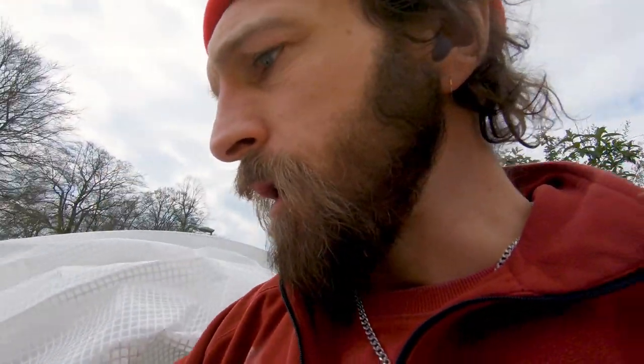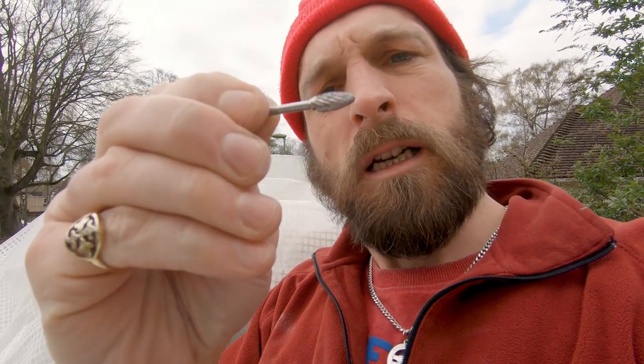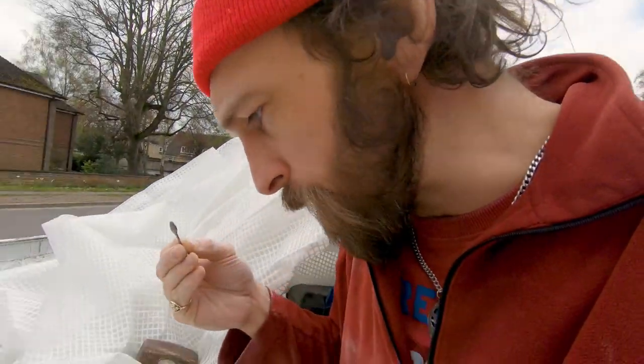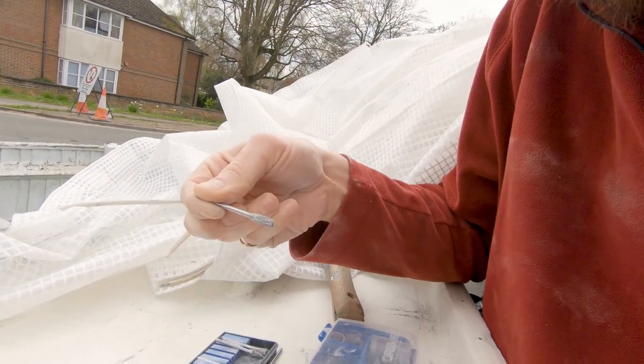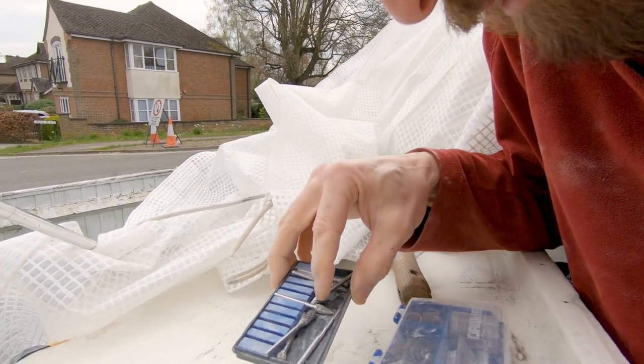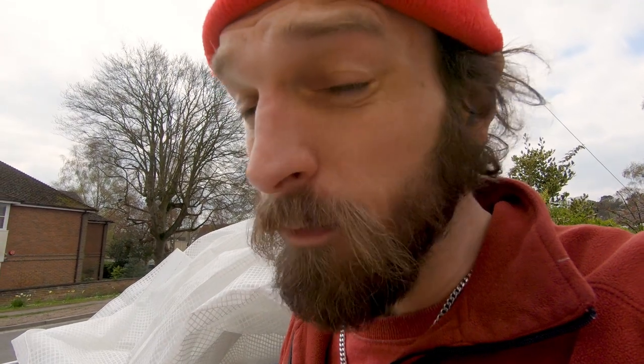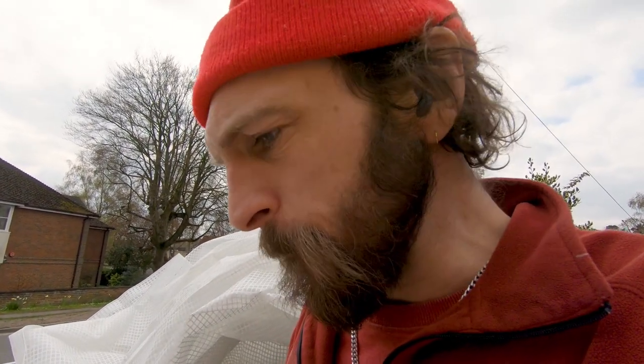Excellent, excellent tool is the thing I've got in the end of the Dremel, that we've seen before, P-shaped thing, but it's a whole set. And these are diamond rasps, I think they're called. And they've been incredibly useful. They don't seem to blunt at all, and they just eat the fiberglass brilliantly. You can do edges, because they come with flat ones. You can see, flat one will do edges. These sharp ones dig out holes excellently. You can undercut with the P-shaped one. Really top tool, right at the top of the list of the best tools that I've been using. I mean, the most useful. Good.